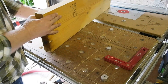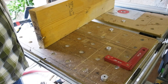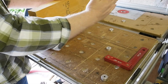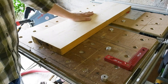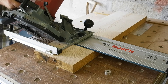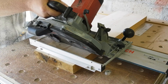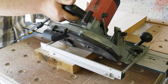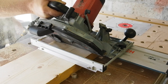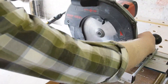On to using it with the bigger saw — the saw I'd more typically use on large structural timbers like this piece from a truss assembly for doing a bird's mouth. You cut those through the height of the timber as I have it stood here. You'd probably cut a whole run at once, maybe just following a pencil line marked across the pieces with no rail. If you've done this you've probably seen the saw get buried in the stall once or twice — you're trying to follow the line, balance the saw, and often stretch to finish the cut. It should suffice to show it can turn a monster saw bevel cut into a bit of a pussycat — it just means you're not having to fight the weight of the saw.